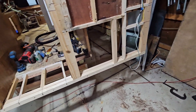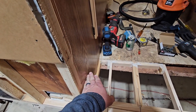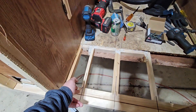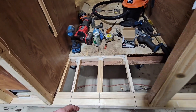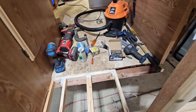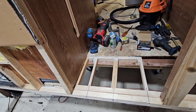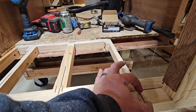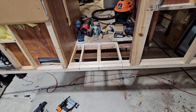Nice and tight and straight. I started doing this framing work here, which is turning out great. I got that two by two underneath the wall that's going to overlap the patch and the main floor. Then I made my floor trusses — one by two, one by two — with the main two by two, everything sunk underneath the floor. Spacer boards give a nice overlap for the floors to meet. Everything's got liquid nail in it, screwed and stapled — it's not going anywhere. I used a bigger drill bit on the four legs so I could start the screw through the second board. Everything is screwed, stapled, and glued — this thing is just getting so solid.